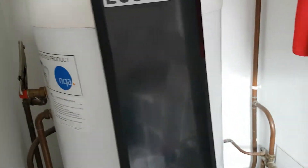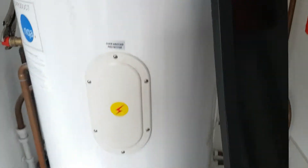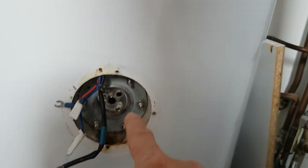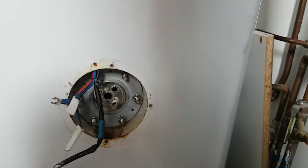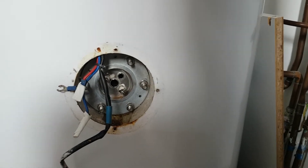It's a Chinese hot water tank, and every year - or every six months - the auxiliary immersion heater in here leaks to ground. The standard English size doesn't fit, and they're quite expensive, these heating elements, and clearly they are not suited.